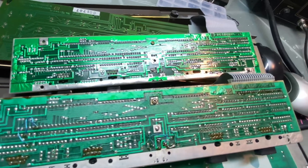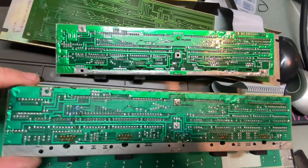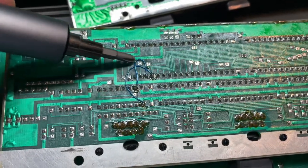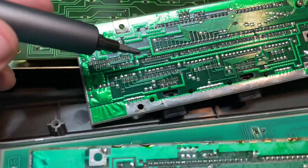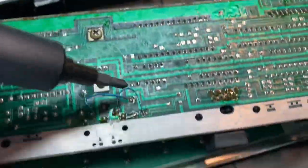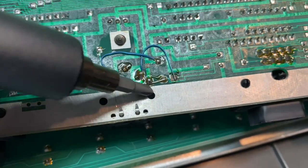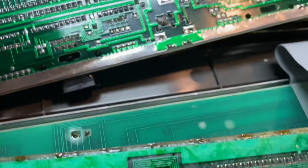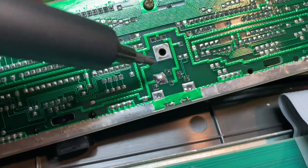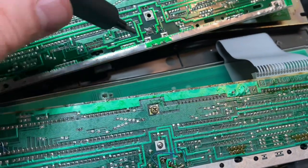We do know that when we flip it upside down, there's diodes and capacitors in different spaces, in different areas. So we do know that there's some holes that are in different places. I think it would be really neat to take high-resolution pictures of these boards to understand how these jumpers became these traces. Understand where the similarities are between these two. So you can see here around the connector, we have some traces here that have been scratched away. Things have grounds here, moved to there. And when we move back here, are there similarities? Well, it looks as if the pins on the connector here are in entirely different locations than here. They don't look like the same pinouts at all.